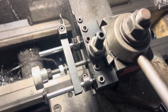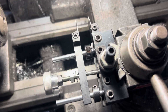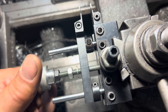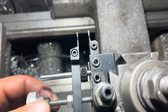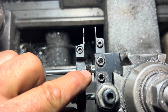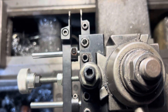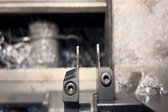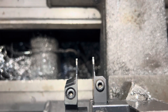All right guys, I got it mounted in the lathe — nothing fancy here. I set the locking collars one and two. The battery just died on my digital calipers, but anyway, this is the knob I just made. I'm going to bring this in until it seats, lock it down, then bring in the lock nut. I got it roughly set to half an inch. What I do is take a first test cut, and if it's slightly under I bring this locking collar out a little bit — it has a little play and helps with fine tuning. Once you get it set it's rock solid and it'll just make the half-inch bushing over and over. You can see I offset the parting tools slightly so the first one cuts all the way down to center, and then the second one follows behind it and parts off the bushing.